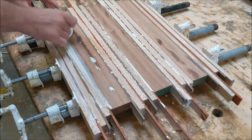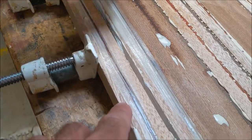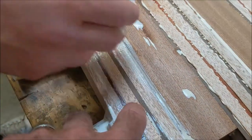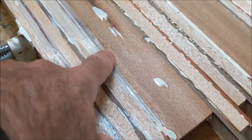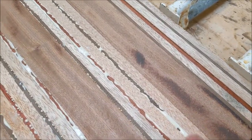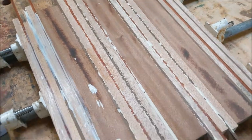Okay, here's our clamp glue-up. So here's mahogany from the water ski, a little thin strip of padauk, water ski mahogany, black walnut, mahogany. There are a lot of strips mixed in there. Didn't have quite enough time to glue them all up, so we only went to here. We'll let those dry and then glue the rest up and put them through the planer.